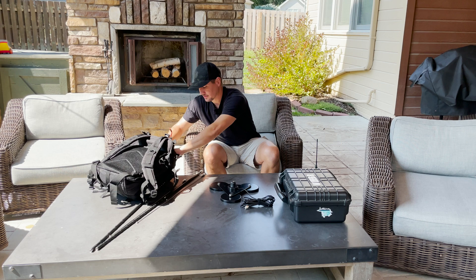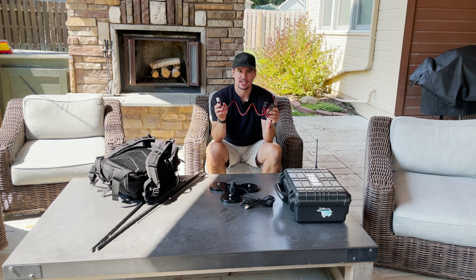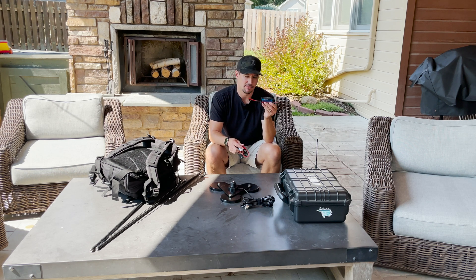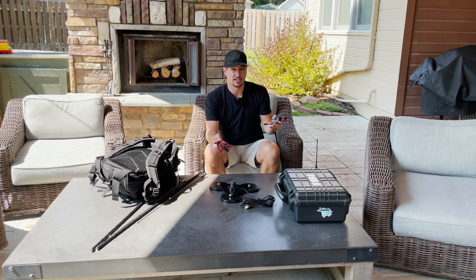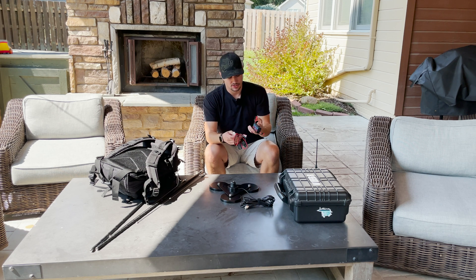Next, a very important aspect is the power cable. I bought a spare ICOM power cable so that I don't have to unplug and bring the cord from my base station and undo all the wiring behind my desk. And you're definitely going to want one of these wattmeter and power analyzers. These are super cheap — Amazon, $20 or $30. Get the one with Anderson power poles on the end, because this is great for monitoring your battery usage, especially if you're on a camping trip. It tells you how many amp hours you've used and what your watt draw is.